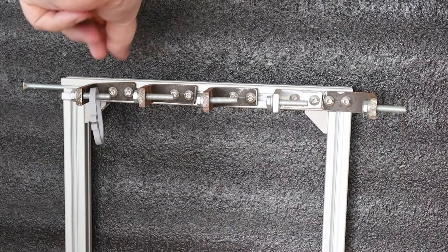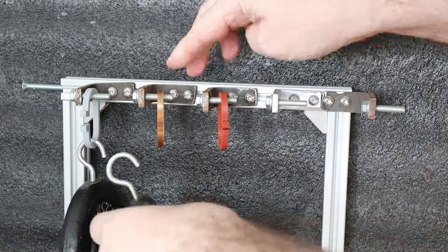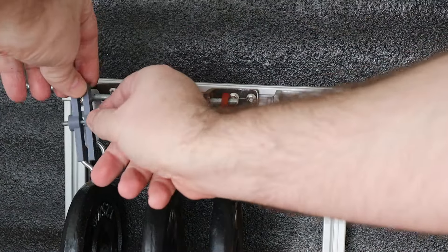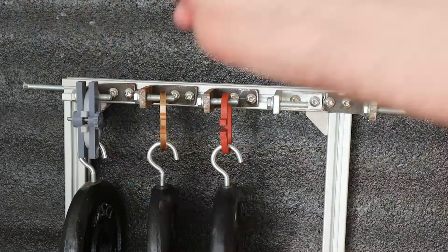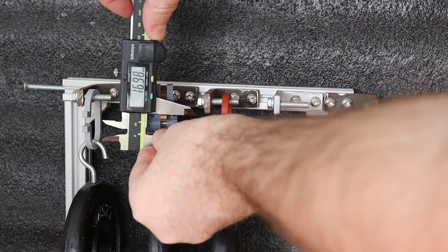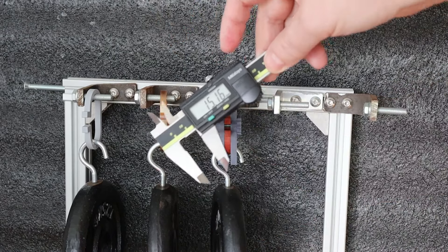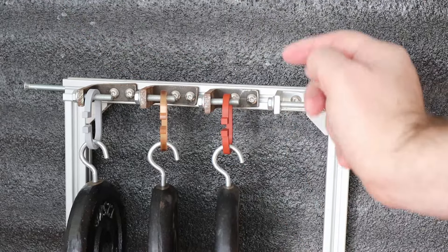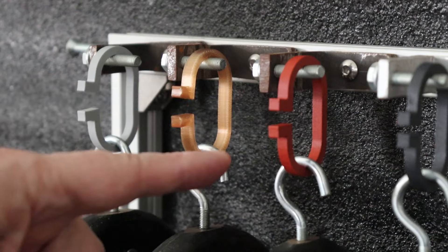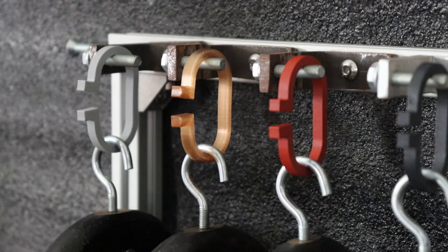The creep test: deformation under constant load of 1.25 kg, measuring the distance between two reference surfaces. I am locking the position for more accurate measuring. The basic and translucent show more deformation, and the smallest deformation is on the carbon fiber version. Now I will measure them every day. On day 5 the smallest deformation is still on the carbon fiber version. These two are similar but slightly better is the translucent. Now let's remove the load.